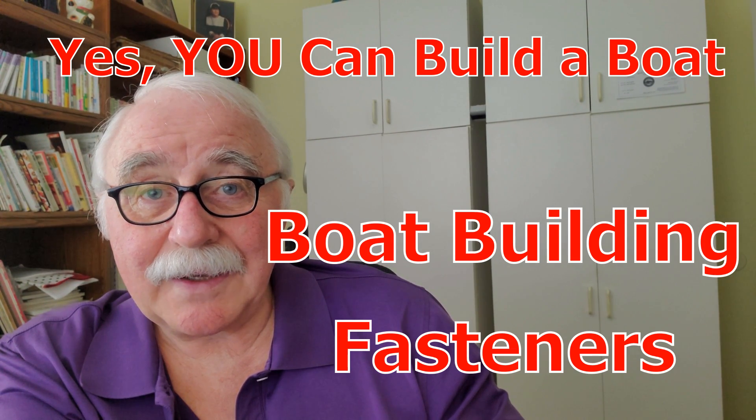Hi, Jeff Spira here again. Today I want to talk to you about fasteners used for boats. The modern plywood covered framed hulls like I design are a little bit different than the old traditional wooden boats that were built. The Carvel Plank framed hulls used a different sort of fastening method. Those hulls were a bunch of loose pieces all sailing together, loosely held together with fasteners. Whereas my hulls and a lot of the more modern designs are a single unitized structure. So the whole purpose of the fasteners is a little bit different between the two.